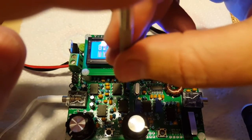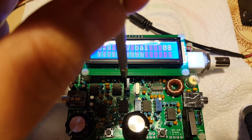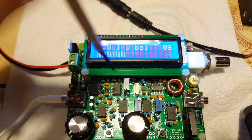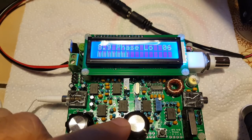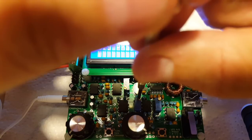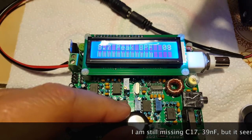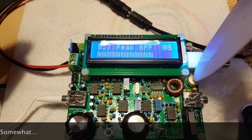I'll keep turning it in the same direction. You can see the value going down — 10, 9, 8 — there it goes back up, so this is just about the minimum. Now we go to phase audio shift on low, and I'm going to set R24 for minimum value. The lowest number I get is 4, so I'll go as low as I possibly can. It's kind of approximate but oh well. Now I have to do the bandpass filter again because those adjustments influence each other — I may have to do it two or three times.